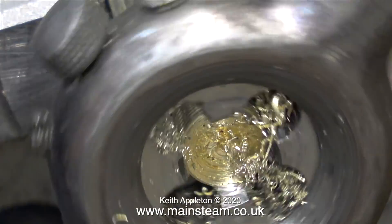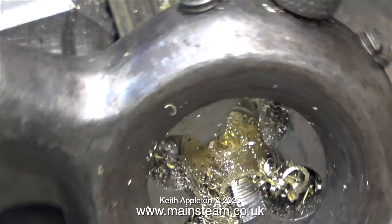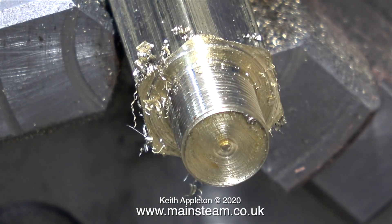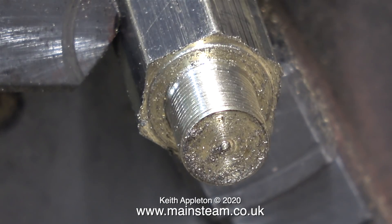My comments on Alum Bronze only apply in the home workshop — in industry it's entirely different. Before I made this video I always thought that the disadvantages to using Alum Bronze were twofold: it's hard to machine using blunt tools, it's very hard to mill using a blunt milling cutter, and very similar to Phosphor Bronze, during any cutting processes the part gets very hot indeed — far too hot to touch with your fingers.